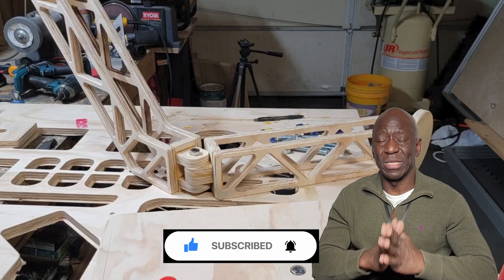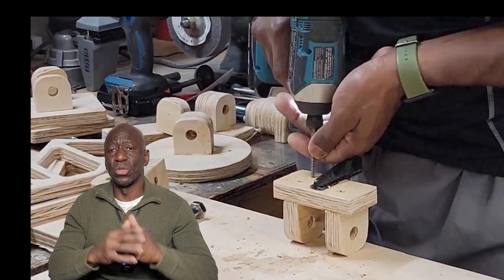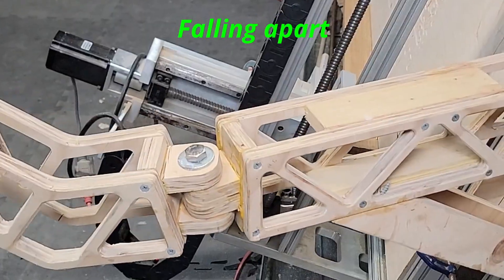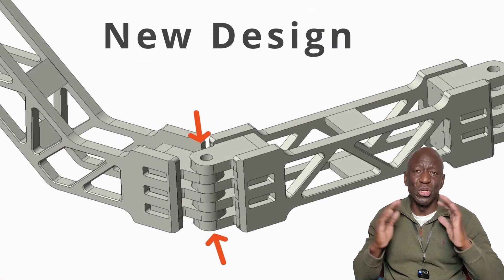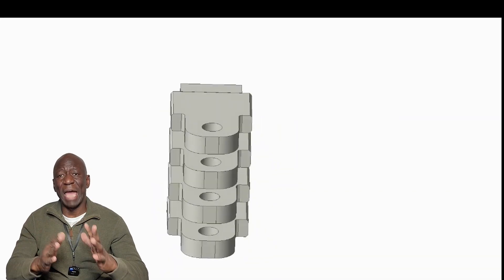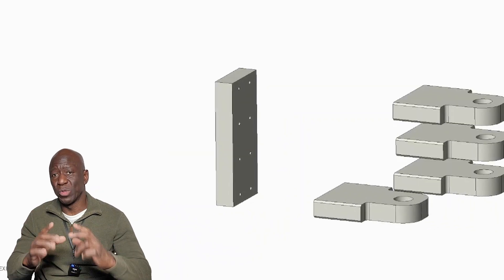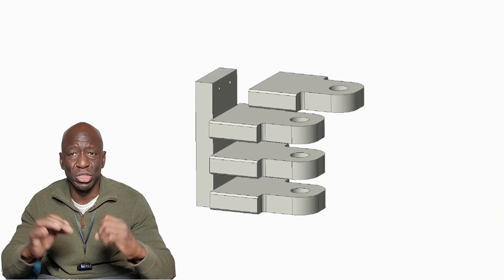I began by addressing the pivot joint, which originally had only four flanges and was held together with only glue and screws. This construct is falling apart. The new design will have multiple flanges that are seated on the shelved cuts. The flanges will have a universal design that will enable any number of instances to be grouped together as shown, prior to assembly with the side frames, to create a modular subunit.